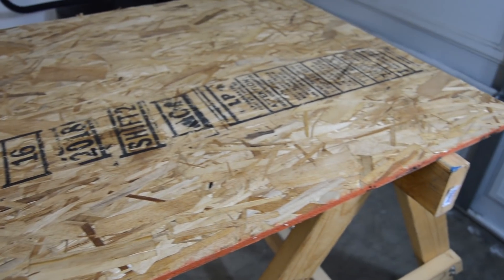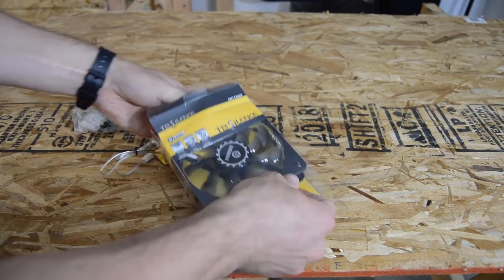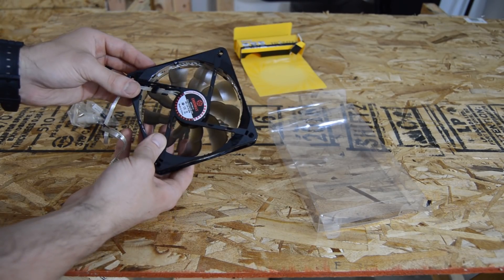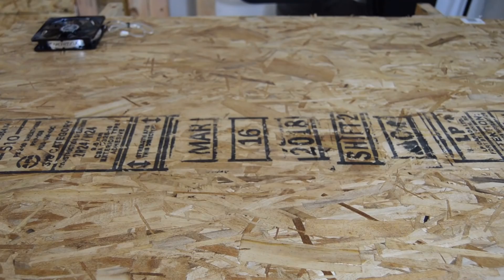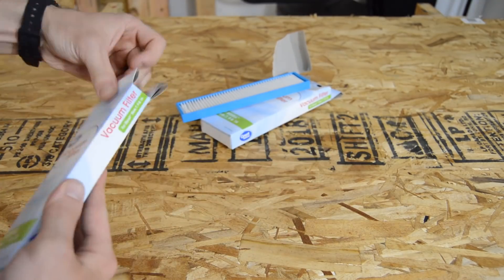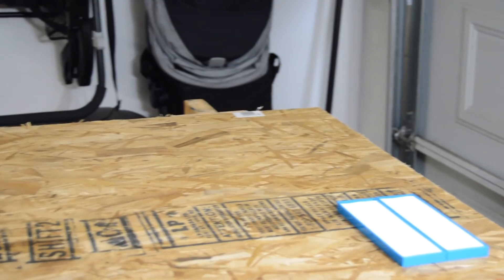I cut the bottom of the TV cavity. This board must support the weight of the TV and was cut from 3/8-inch OSB. I installed a PC fan to provide some circulation in the TV cavity, since the TV itself still consumes about 100 watts of electricity and that heat needs to be exhausted somewhere. I also installed a couple of vacuum cleaner filters so the air pulled into the TV cavity is clean and free of dust and debris. The circulating air will enter through the filters on the front right-hand corner and get exhausted through the PC fan at the back left-hand corner.